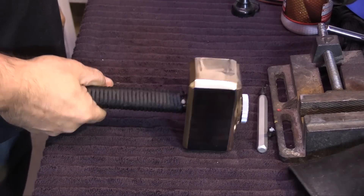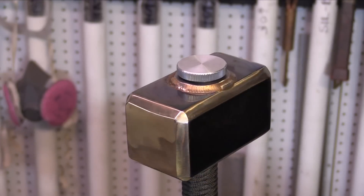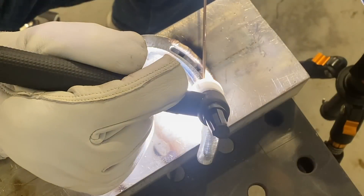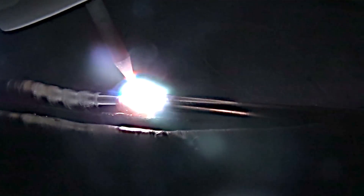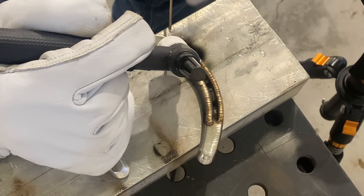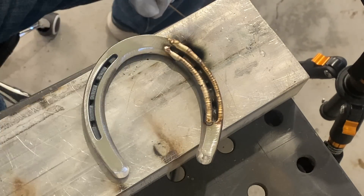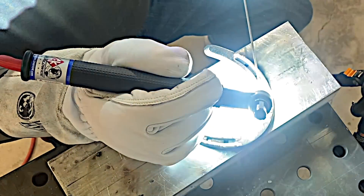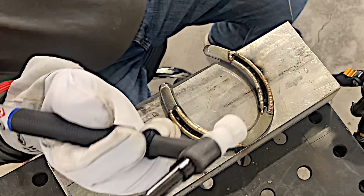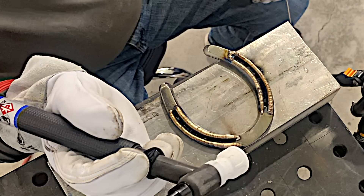Another application was this where I made a little hammer project — kind of a Thor hammer, dead blow hammer, where I had BBs in there. It makes for a really cool look, but I'm using those same basic settings for this horseshoe overlay. I'll show a few good tight arc shots. As you can see my technique, I'm moving ahead on the high part of the pulse and then backing up just a little bit while it goes to that low amperage, and that's keeping the puddle cool and relatively clean.